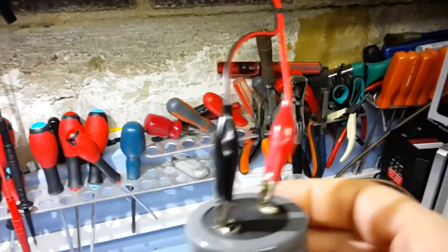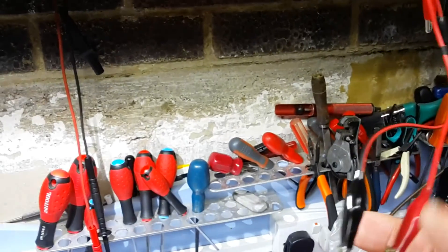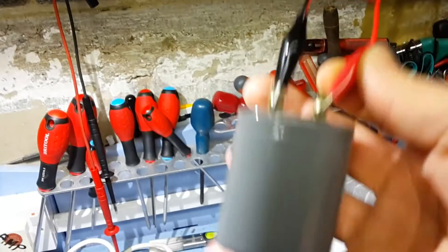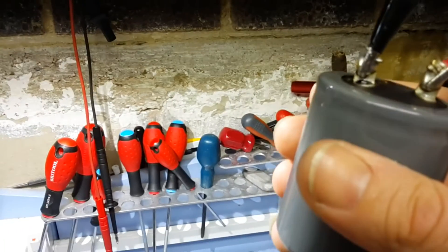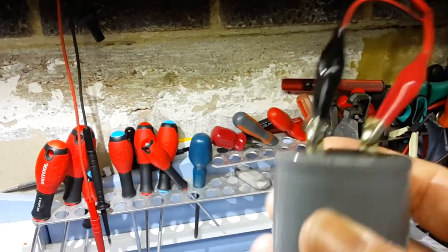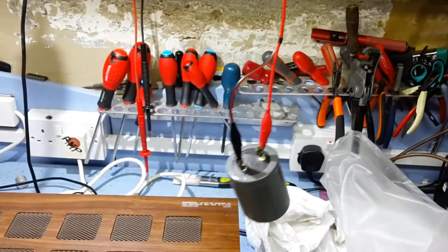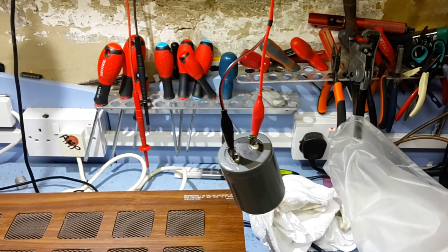That's a good sign that you should look at these capacitors before you use them. Don't always assume that the capacitor meter will tell you if a capacitor is bad or not, because this one is short of going bang in your face — drawing half an amp at 50 volts. That's quite a lot of power being dissipated in this capacitor. So this capacitor is knackered. Just a word of warning — I was messing around with this capacitor, about to throw them away, thinking maybe they're useful, but it doesn't look like it. Just be careful with these electrolytics because when they explode, they really do go.